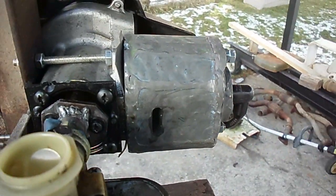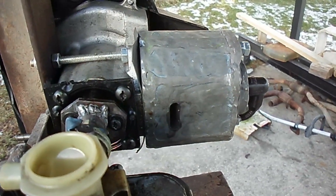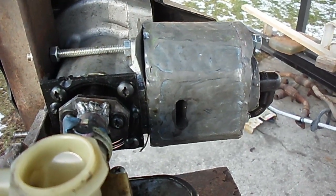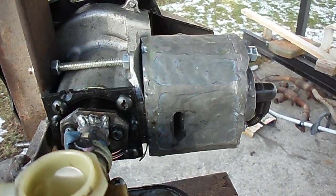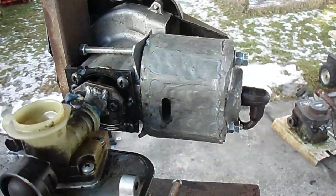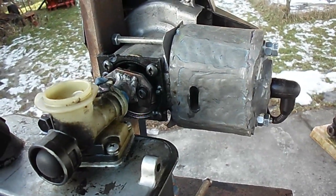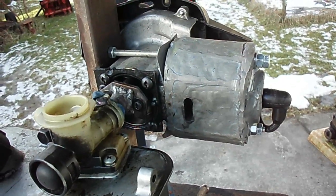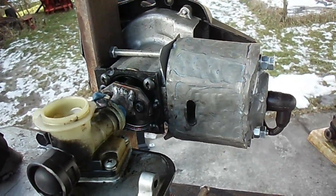So I think what's happening is it runs and then it gets too hot and starts seizing the piston. When you start pulling it, it begins making a squeaking noise, kind of like the piston getting tight in the bore. In this configuration, all I can get is about 12-second runs, then it gets too hot and seizes up. The engine is revving wide open the whole time.